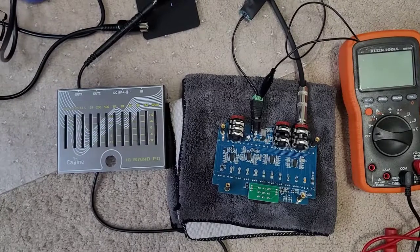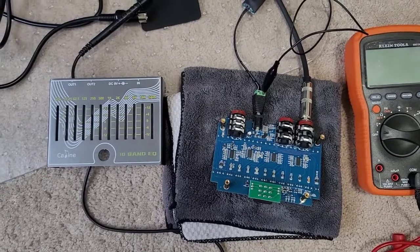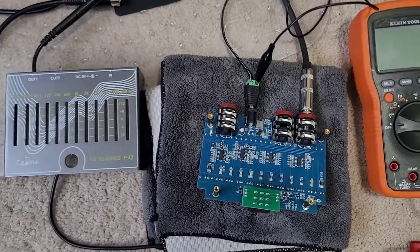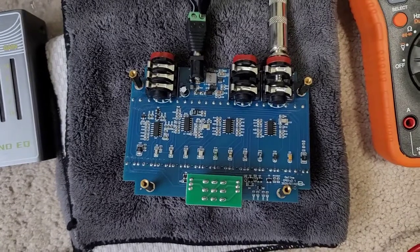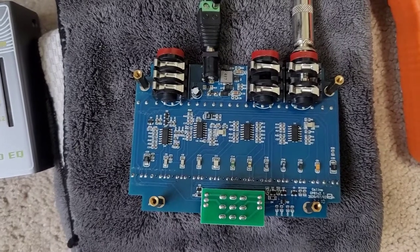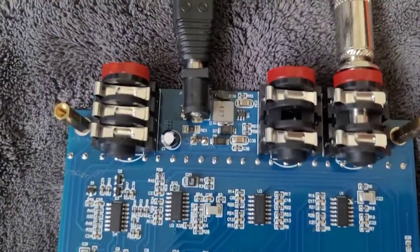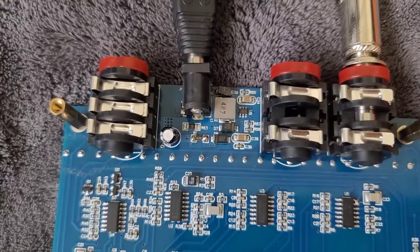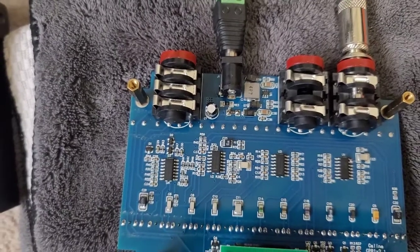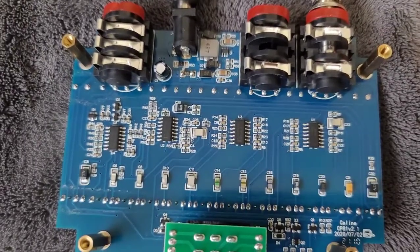At the time of recording this video, I have been in contact with the engineer and the product development specialist for K-Line Technologies over in China. I'm on the eastern seaboard of the United States, so there is a bit of a time lag between the communication. They have indicated that they have amended this board and are sending me a new version to test out. They sent me the schematic for version 2.1 — it is missing two inductors and a capacitor, because I don't see them on this board, but it's part of that up-converter circuitry.